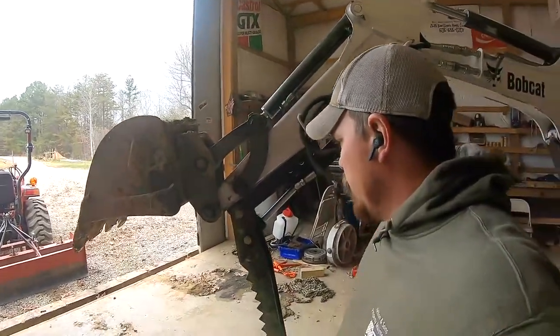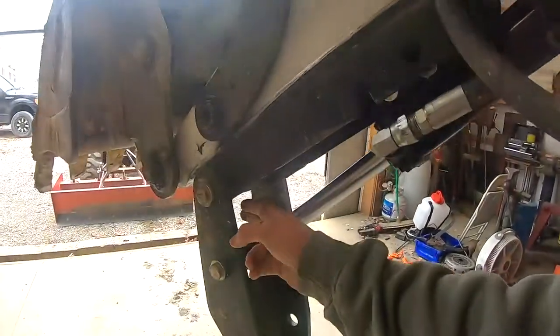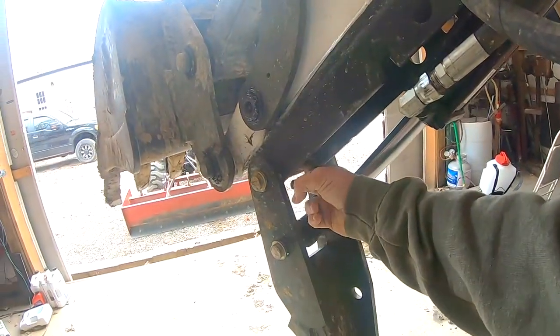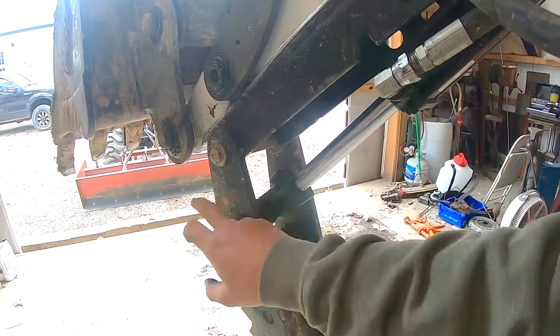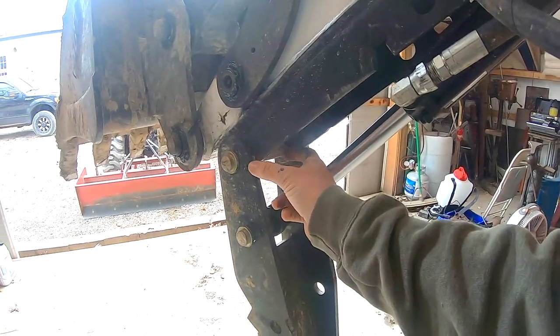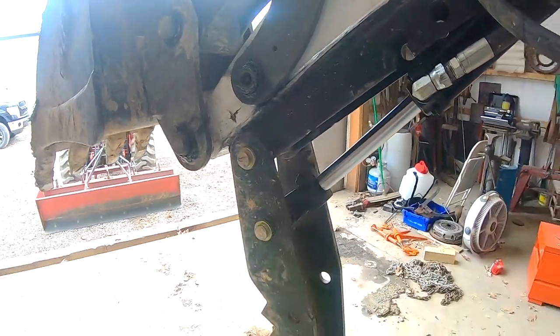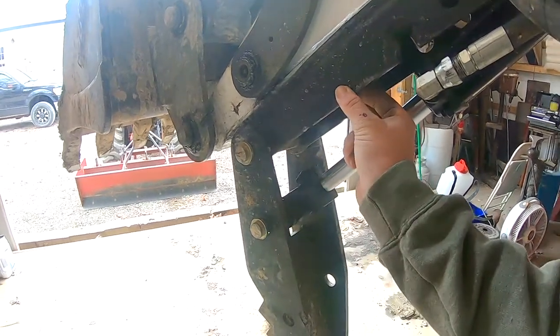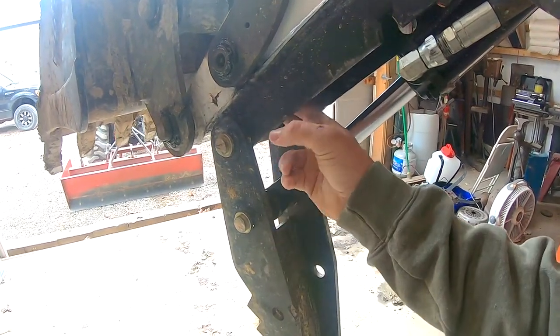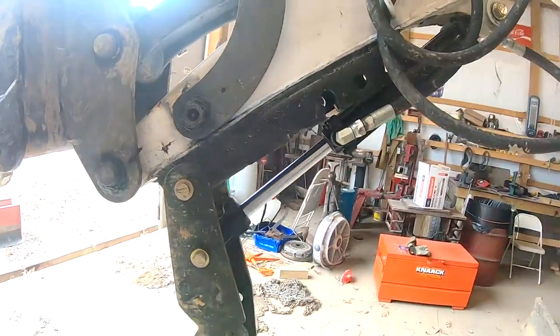So I'm going to have to do yet again some more modification. My plan is to add steel to the inside on both of these, re-drill the hole after adding steel so it has more surface area — maybe weld, fill this back up, re-drill it out. Maybe that will hold up, because this is thinner than that. Maybe that's why this wallered out quicker, because the outside ain't too wallered out. I'll take it apart and let you see it.